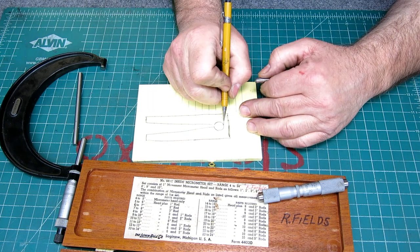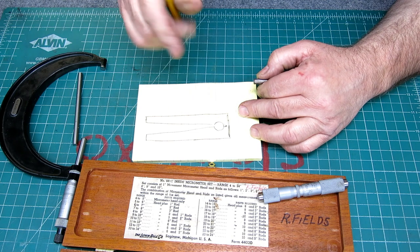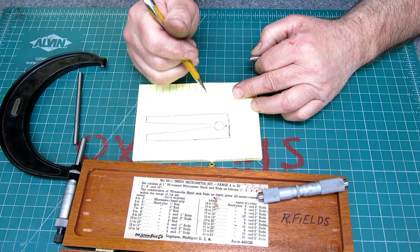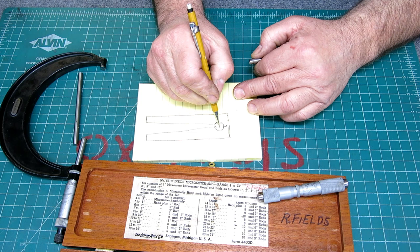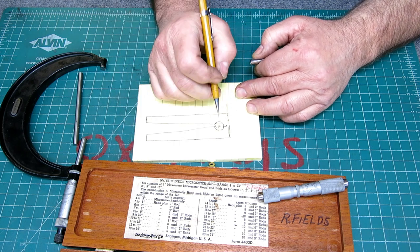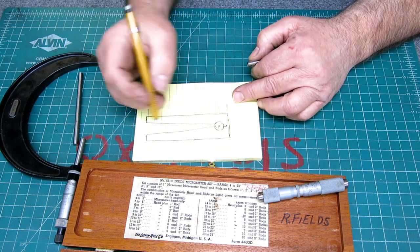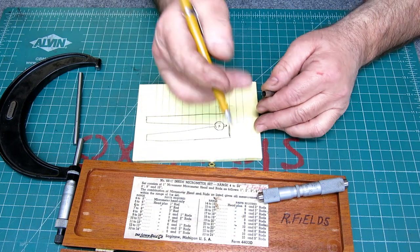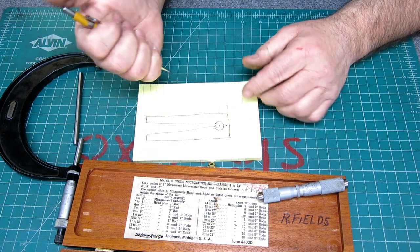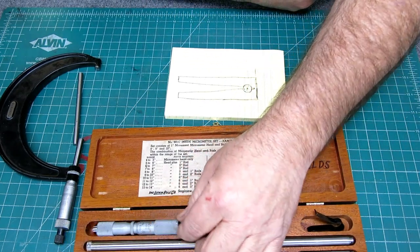If you want to make it a little springier, you can continue your bandsawing a little bit further. But this hole needs to be reasonably close to this edge so that it can flex a little bit. Then you slip it over that, and you pinch down on that, and you have basically the same thing as that. So if you're missing that particular little wrench, that's one way you can get out of trouble.